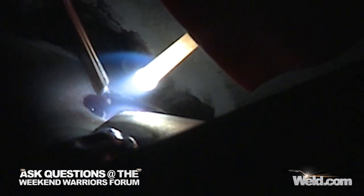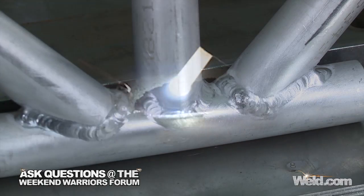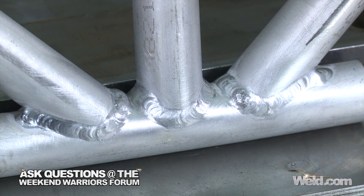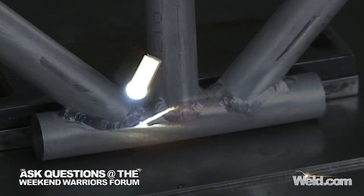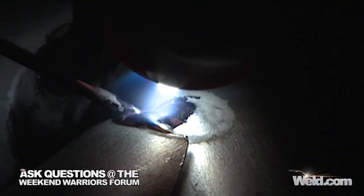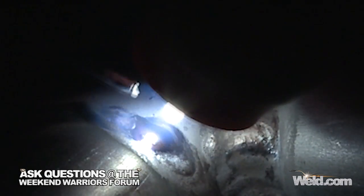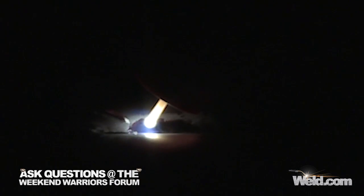Now that I've put the 45-degree mitered sections in and welded it all the way around, what you have to do is focus in, do a visual inspection, and make sure you don't have any undercut. You'll take this entire sample along with all your paperwork and send it to a lab. We're going to provide lab options here in the near future. It's probably going to require a visual penetrant inspection, and make sure your lab buys it off — typically it's going to be an AWS certified person that does so.